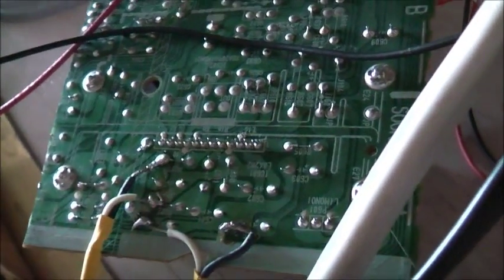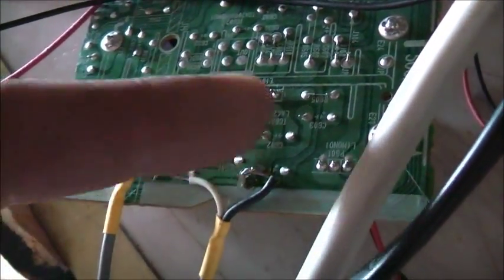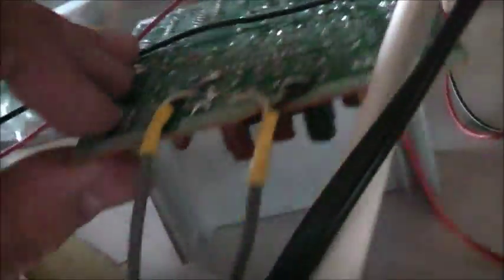So it's kind of working as a mono/stereo amp — I'm not actually getting true stereo sound on the speakers at the output. Here on this circuit it's all coupled together — I've got the capacitors and resistors and half of that is joining the two signals. The left channel is getting both channels coming through.